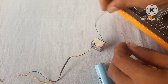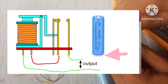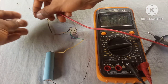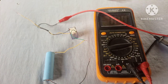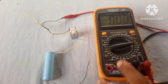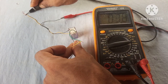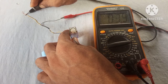Now we're gonna hook up the terminal of the battery — you can use any terminal — and hook it up to the COM. I'm gonna hook up my multimeter probes to the output of the relay to measure the voltage output. We're gonna use the negative end of the battery to touch the coil of the relay, and as you can see we have an output voltage of 3.9 volts.